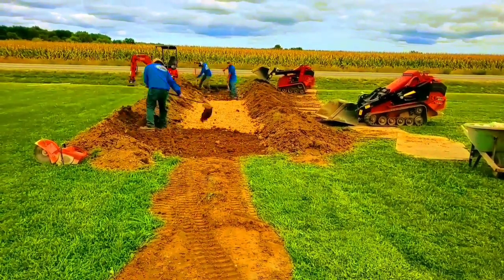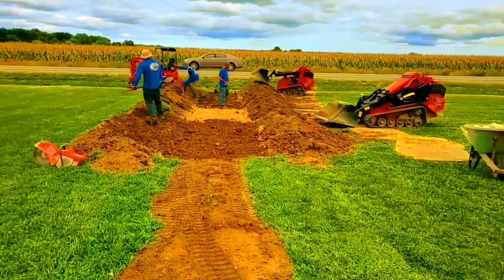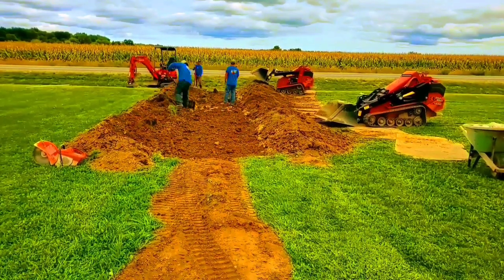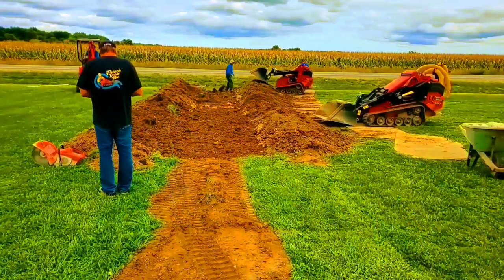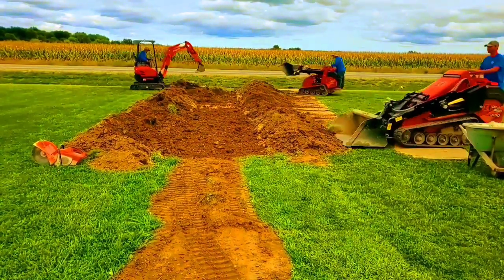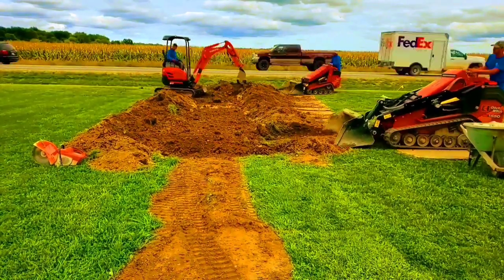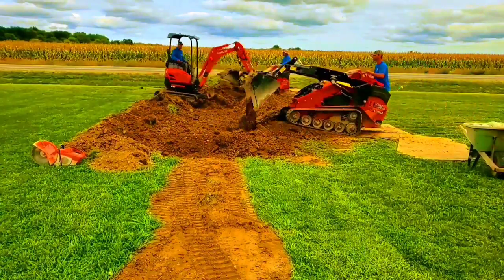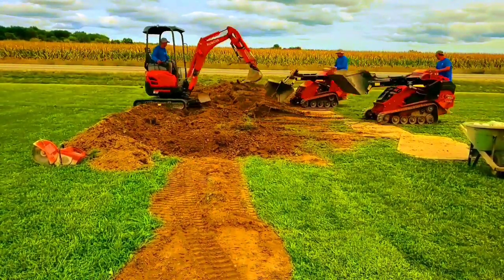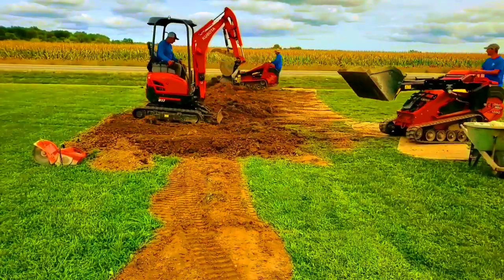So we don't mess up the leach field, the guys go ahead and hand-shovel — and this is great because you're repurposing the same soil you just removed to build the leach field. We don't want equipment to damage it; you have to be very careful with leach fields. Once you cover it with a certain amount of soil, it's safe to go over with a tracked machine. Notice how all three machines being used are on tracks — that displaces the weight over a larger area so you won't harm the leach field. You really don't want to get on a leach field with a rubber-tire machine like a big skid loader. Once it's done and finished, you're fine to roll over it with a lawn tractor.